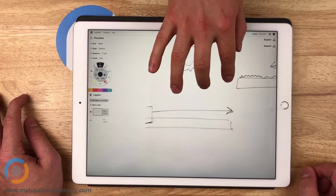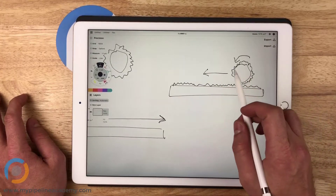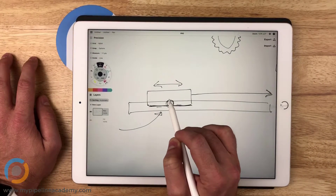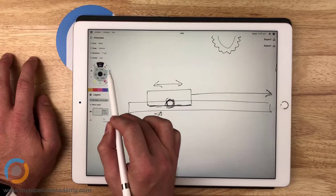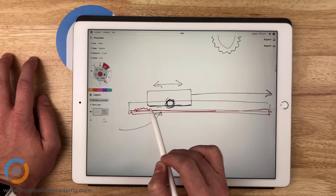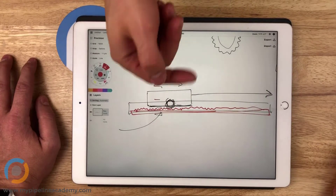How can we apply this to the example you were just showing? If instead of using a spur gear, we mount our rotary damper right there — it's got gear teeth coming off it. And then down beneath it, we put our rack with teeth like that. That's the answer.